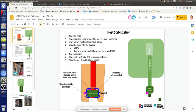In a way, but when you have specialized components, like that rotary switch, I like using the diagrams because I can show the actual picture of the component, which Fritzing may not have. Fritzing will be more generic. I could try to figure out how we can integrate. But you can add library parts to Fritzing. You write down how it connects and put a graphical image of it in there to create a library part. Can you make any KiCad PCB a Fritzing element? Fritzing will not allow you all the variation that KiCad has.